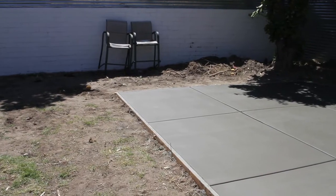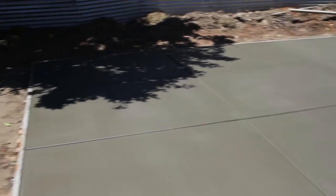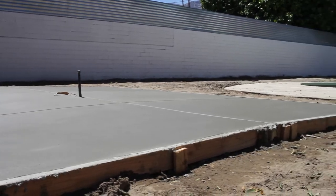The concrete went in and everything went pretty well. The finishers just left — they put a nice broom finish on it and we have control joints, which you always want so it doesn't crack in the future. In a couple of days we'll take the forms out, get the soil nice and level, and start laying down the grass. The fire pit area turned out really good too — a little smaller but we don't need it as big since the fire pit goes in the center, and the gas line is already run. On the next video we're going to be talking about how to install the brick that goes on top of this, so stay tuned and don't forget to like the YouTube channel.